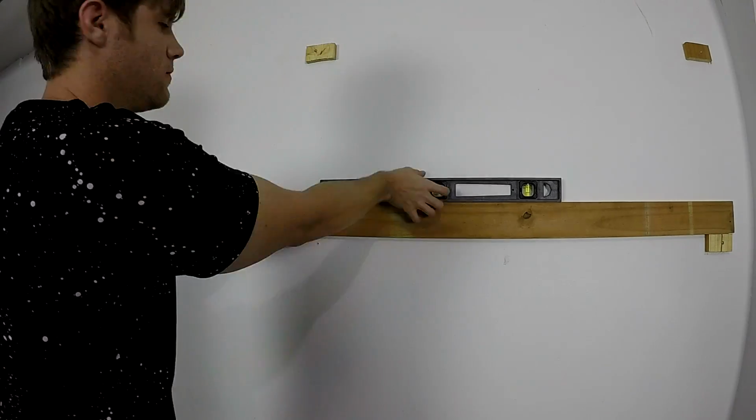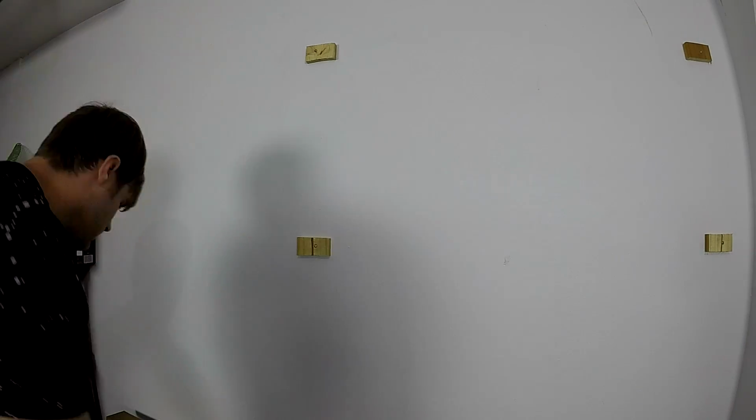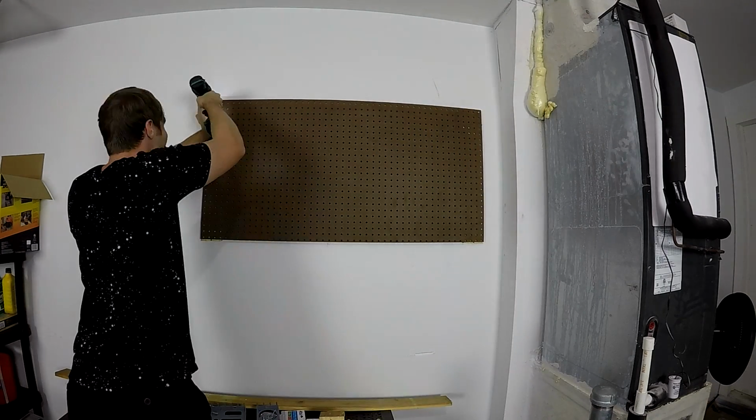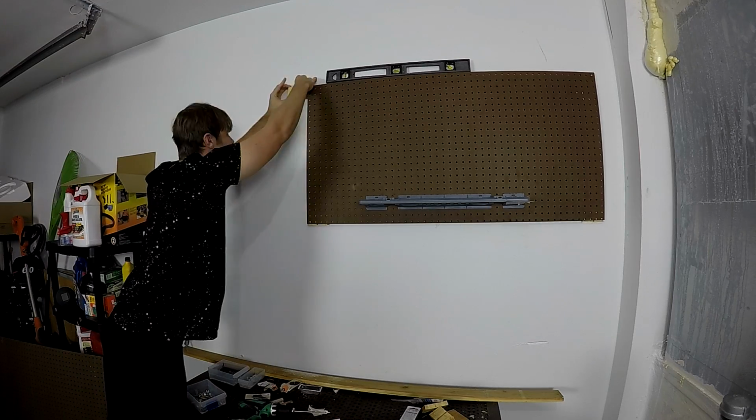The whole reason for that was just creating a place that I would actually drill out even larger using a different bit later. So basically I'm just drilling through the wall to leave a mark that I'll then drill through with the correct size later. That way the butterfly anchors can slip through and open up on the other side.